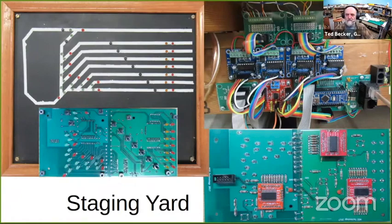Oh, and the red board down in the middle here is another IO expander that drives the H bridges that drive the Tortoises. One note is if you're going to drive a Tortoise with an Arduino with H-bridges like this, a very nice plug-and-play sort of arrangement, it takes two I/O pins to drive a Tortoise.